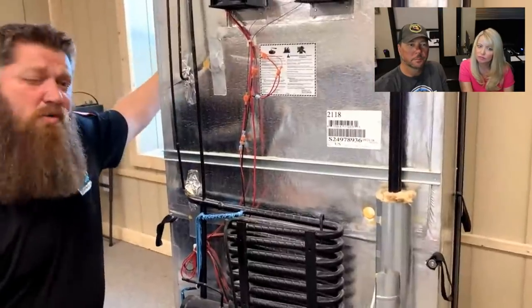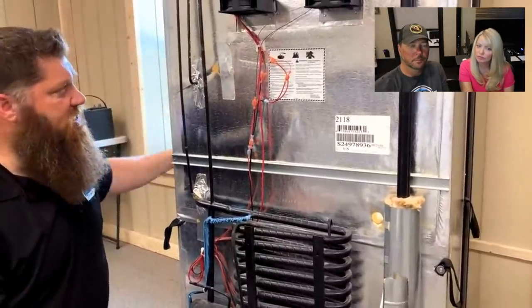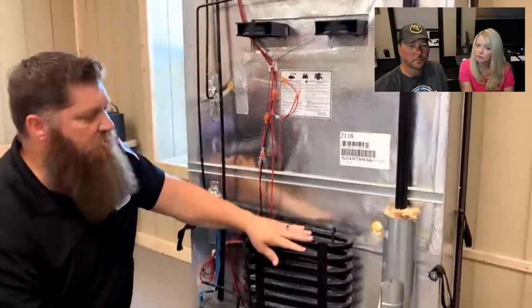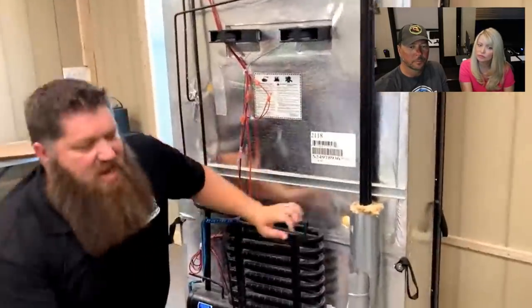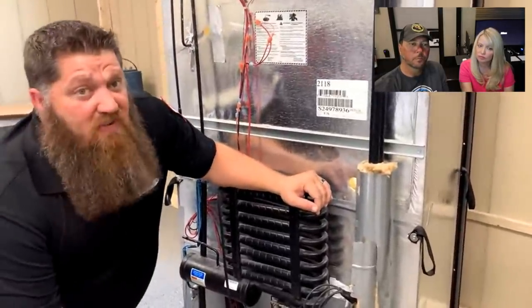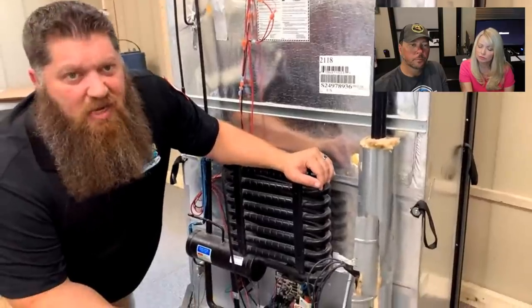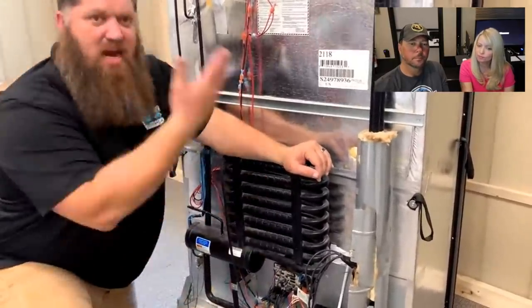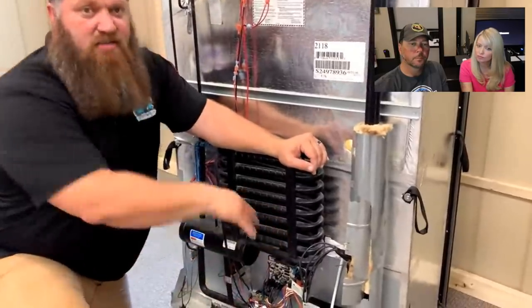And we want to take the warm air that's inside the refrigerator and freezer and pull it out. That's what these are out here. These are the heat exchange. Now, here's the thing that I also saw with several of the Norcolds is the refrigerator works fine in the morning, but as the day gets going, the refrigerator is not working near as properly. It all has to do with airflow. We want this hot air to escape.